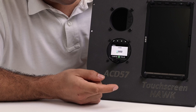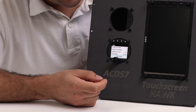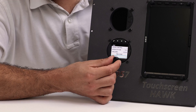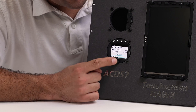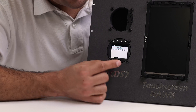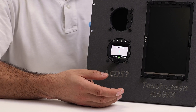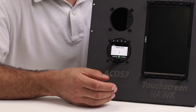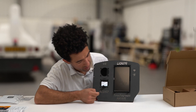To load a license code, you need to firstly go to pin code at the bottom and select that. The code is 3000, and this initiates the setup mode. You can scroll to the bottom, select Licenses, then Install. Here you put your setup code and that will activate that feature. We're going to leave this page and quickly run through the setup to show you the various options available.